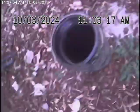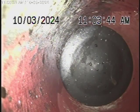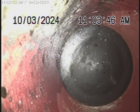We're going to bring the camera out of the clean-out over here and then go to the other clean-out and run the camera upstream. Running the camera upstream, we've come to the end of the line. Pretty straight shots — all clay pipe. That's where you can see where the house connects. The section of clay piping underneath the concrete walkway outside is all in good condition.